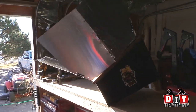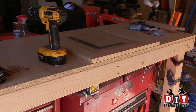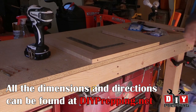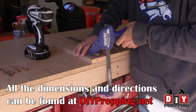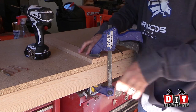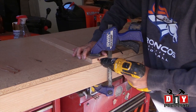I put together the top - the frame around the outside, the glass, the seals, the hinges, and those adjustment guides. I started with the outside frame and used oak because it's a prettier wood, but it is a hardwood, so when you put the screws in the four corners, make sure you drill a hole first or you will absolutely split the wood. I used 45-degree angles - a little bit of a pain if you don't have the right tools, so you can just use straight edges.